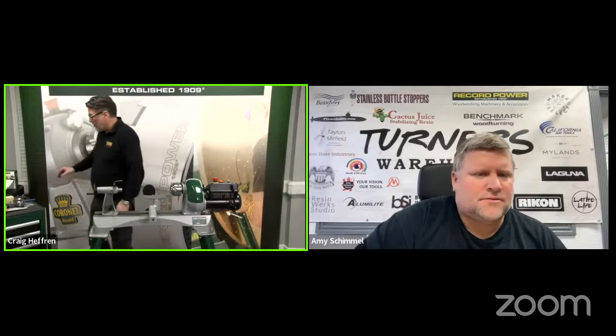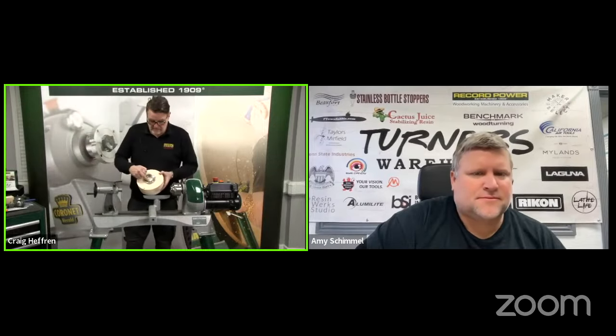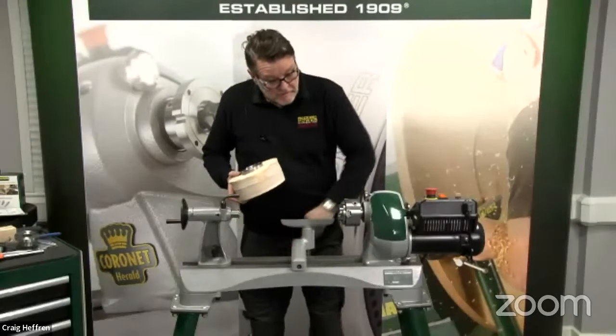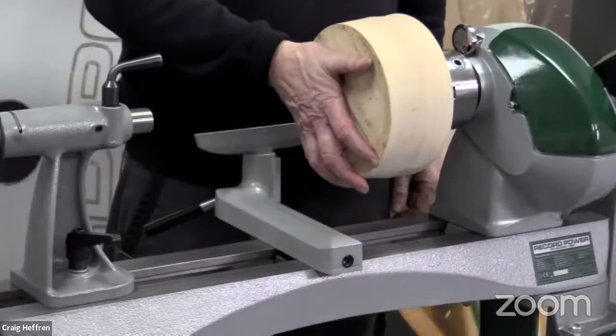And then if you're doing a bowl, for instance, on this one, part of the SC4 chuck, you would get the small face plate with a dovetail insert. You get the 50mm jaws with the SC4, and that would attach straight onto there and open up.